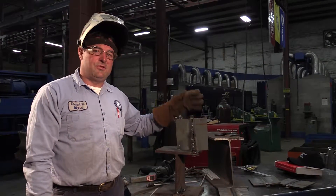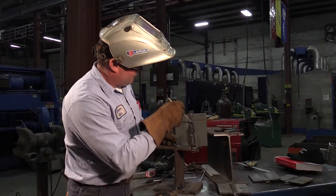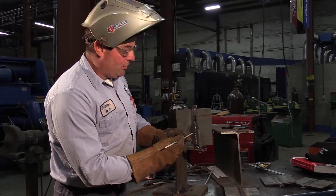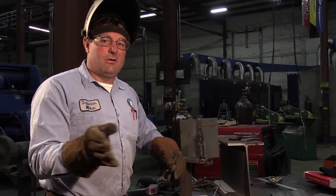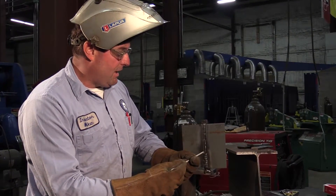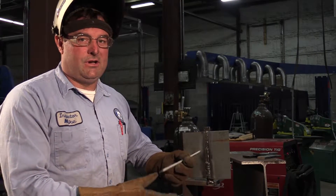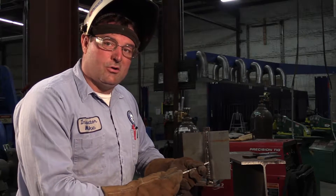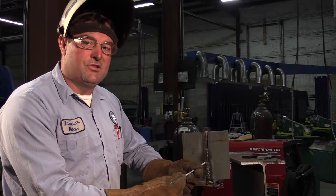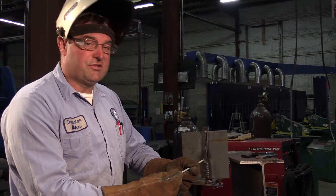Now we have the SMAW coupon. We'll finish welding this out with 7018. I've already welded the root pass and mid pass and started some of the cap. I'm going to finish running some more of this cap to show you the difference in my movement. With flux core I was really fast side to side, not pausing on the edges — total opposite with this. With the slower deposit rate of 7018, I have to come across and pause and let the toe fill out, let the puddle catch me. Once I see that filling out, I'll go back to the other side and do the same thing — go across the center fast, pause, then come back across to the other side and pause.